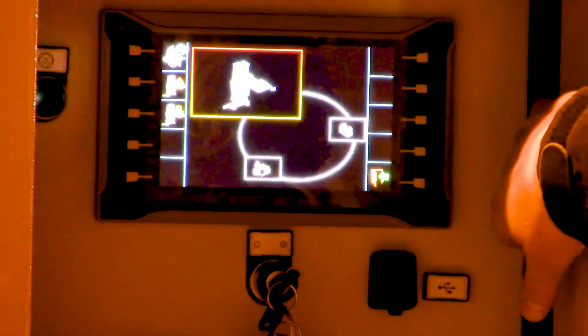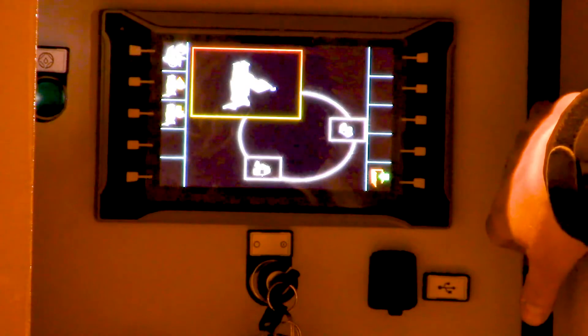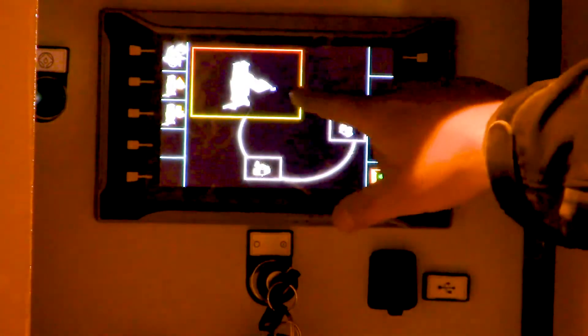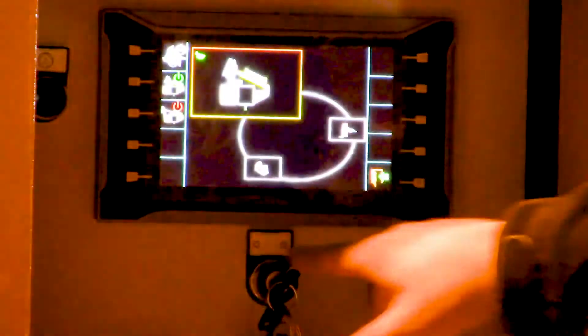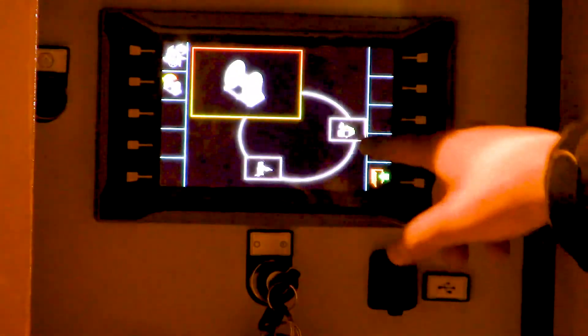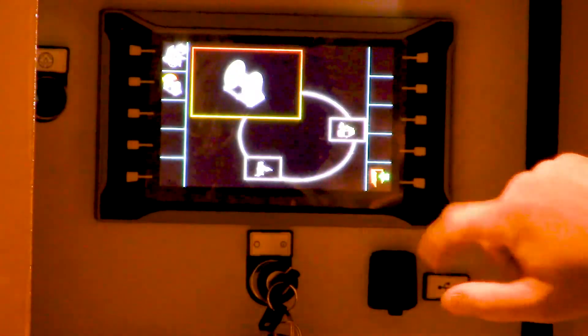Next we have our hydraulic functions — the accessories of the machine, like up in front of the machine is the front plow. There's a rope clamp attached to the machine as well for blocking any movement of the rope, and then we can manually activate the reel winder to whatever pressure we have set by pushing this button here.